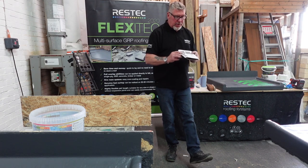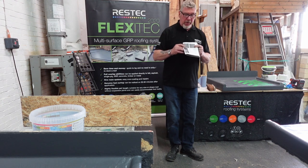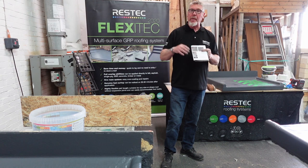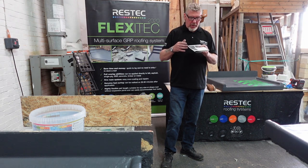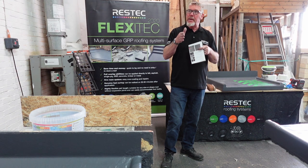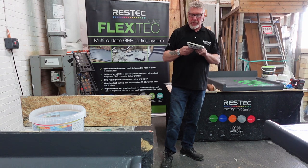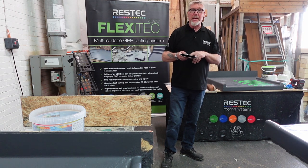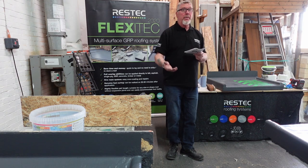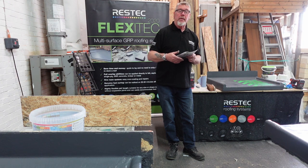Resin application. Forget the top two pictures, the top four pictures, we've done them. But the bottom two pictures, the one with the tick on, you all achieved that today. You're all going to achieve the swirly fibres. We're not talking like a curly perm, we're just making the fibres go from straight to wavy. If you look at the picture with the red X on, in the bottom left hand corner you still see white fiberglass in there. Not enough resin underneath. Very important: get resin underneath, bring it through. Once it's come through, more on top to consolidate with. Okay with that?